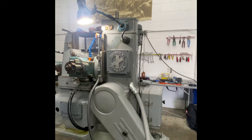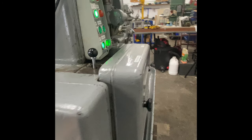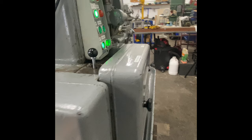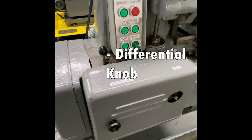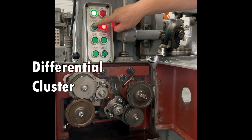There's the machine with the logo, right above the main sheave. The next cabinet is the index cabinet, showing the feed gears E and F, and then A, B, C, and D — the conventional change gear setup. There's an interesting lube system in there. Above that cabinet, by the operator panel, is a black knob that engages and disengages the differential. There's the differential cabinet, showing the differential cluster on the left and the feed cluster on the right, with the operator panel above.